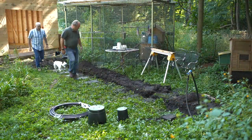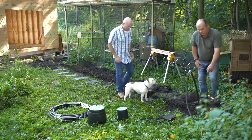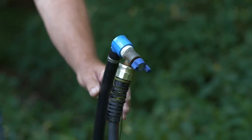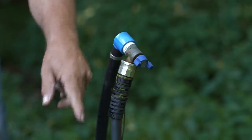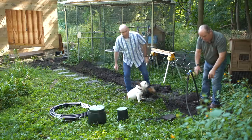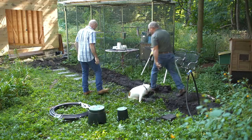So you've been busy, Mark. You dug a little trench here. I got the trench done knowing that you were coming. So here's the water from the house. This is polyethylene — often what they'll use subgrade like this. And this is the connection right here to your irrigation, so all that goes away. Now it goes subterranean. I brought some additional polyethylene. We'll run that in this trench into the building.